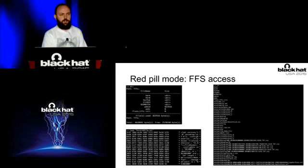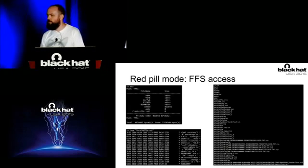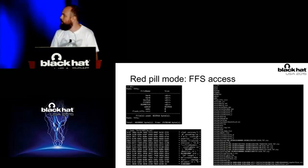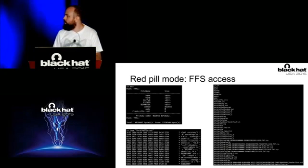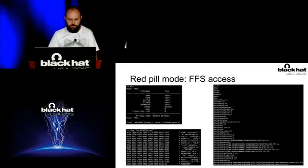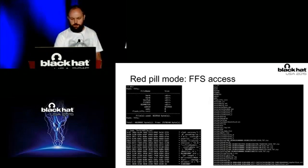We also had full flash file system access right out of the box. It has all the usual commands to work with the files on the file system: list directories, change directories, even recursive listing, which you can see on the right. You can type your files, binary, all the way around. You can see in the left down corner a fragment of the main configuration file. You have CFG XML, which stores all the critical configuration settings for this femtocell.